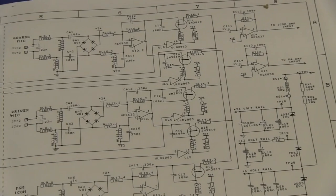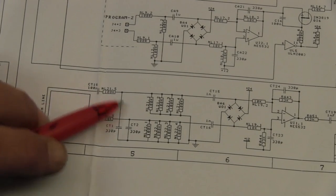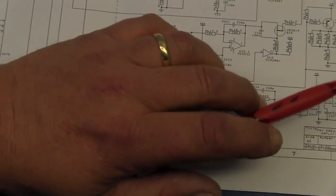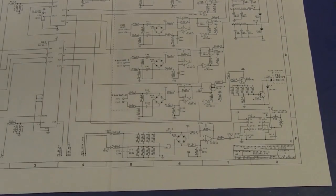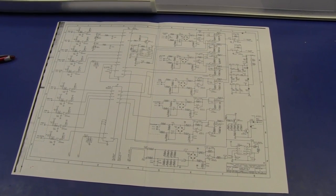Oh, and the only particularly interesting thing here is where we're getting the intercom line, doing a whole stack of high pass and low pass filtering and buffering, and then sending it into this detector for 25 kilohertz. That's our tone decoder, whose output then goes back into the gate array logic chip. So there you go. That's your lot. That is the Sydney Rail...